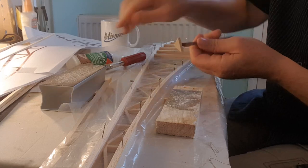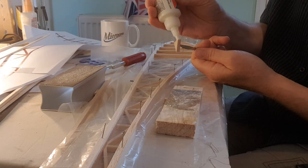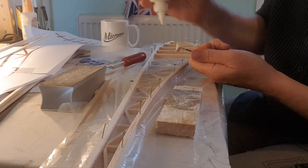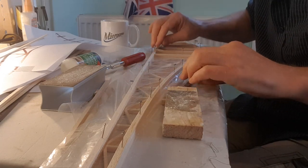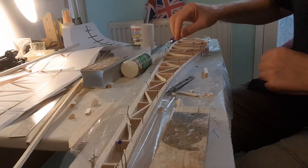I've just pre-glued it. Let's pop it in. This particular gusset is the one that holds the dowel that holds the wing strands on, so no point in cheating on the glue or anything like that. It's got to be a very good fit. It's nice to see the glue squeeze out when you push it in.